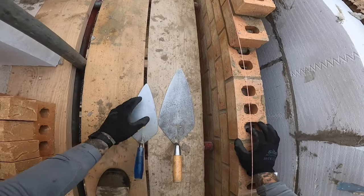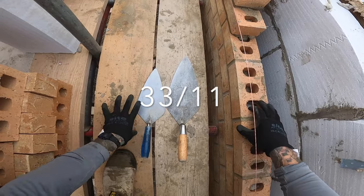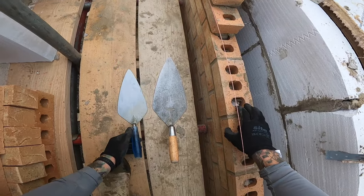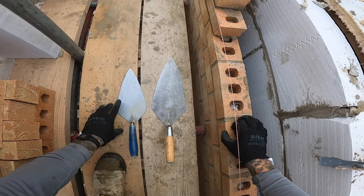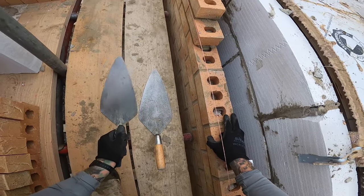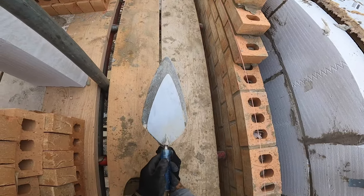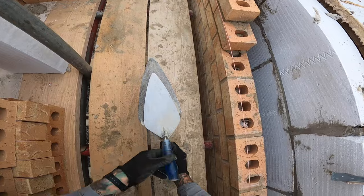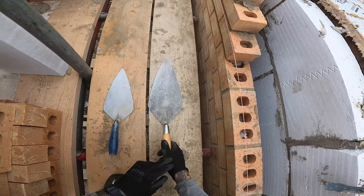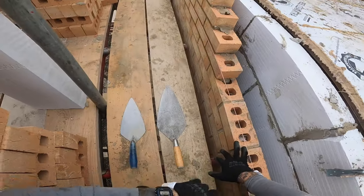If you're doing a long bed you need to find that sweet spot. I'd say personally for a long bed the sweet spot is probably an 11-inch or a narrow London, which is the 13-3 pattern. I used to use the Philadelphia pattern when I first started but I actually prefer the narrow London now. You can see the size difference, but that extra weight around your forearms and wrist is not good for you, so do not use that large trowel for daily use. I'm just waiting for the muck to come up — should be any minute now.